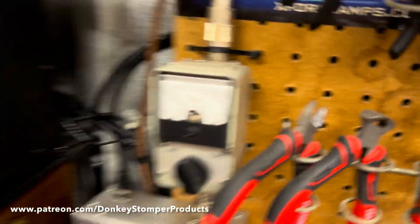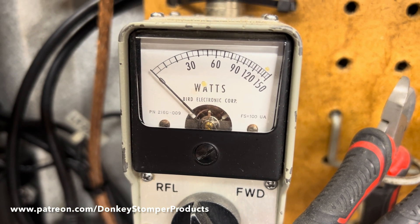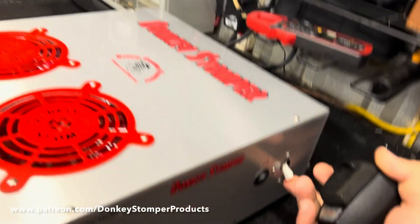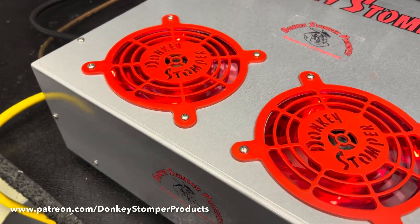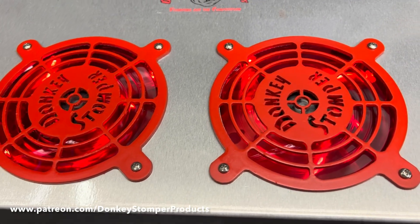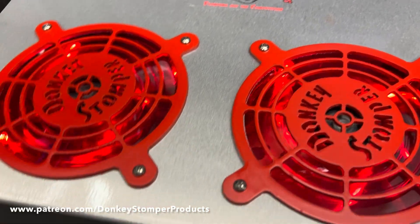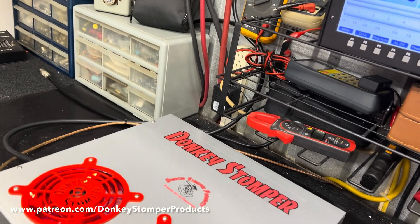Let's start out looking at straight-through SWR. Let's turn it on — the fans are gonna make some noise, that's part of it. It's just kind of like: to make watts you got heat, to move air you need fans. These 120 millimeter fans will move air, and you're gonna have noise. But the transistors are gonna last longer, so I'd rather have a little more noise and have a longer-lasting box.